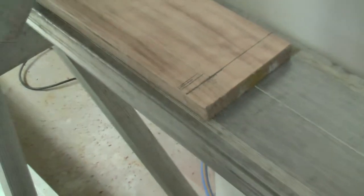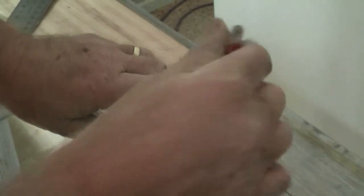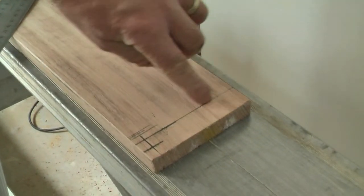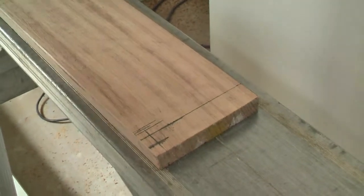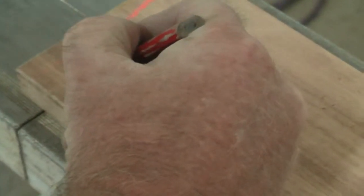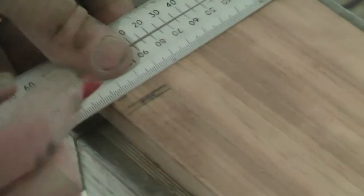This one is a bit tricky because we've got tiles and a strip floor meeting here, so we have to do the bottom a little differently. Where the latch is, we need to come down just a little bit more and leave a small piece on — so I'll cut along there and leave that little piece. At the top end, there are our two marks again. We find the centre and come up 8mm this time — I'll explain why in a moment. So I mark 8mm — that's where I'll cut.